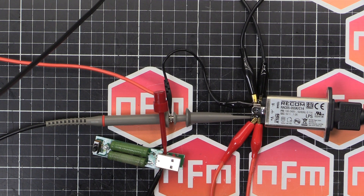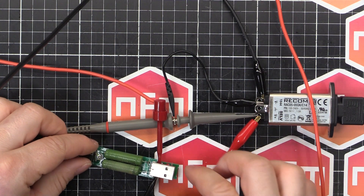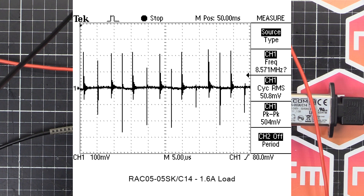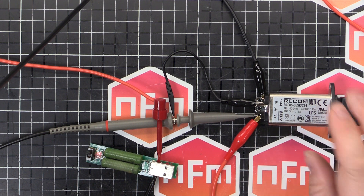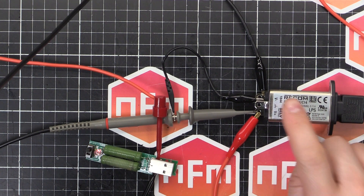If I switch it up to the next setting, which is 1.6 amps — so right now we're at 0.9A and now it's kicking out 1.6A. You can see there's less ripple but a lot more of those little spikes, so it's working a lot harder. This is rated to 1A, and the fact that we can actually get 1.6A out of it at least short-term — it isn't over-temperature or over-current tripping. There's some overhead built into this thing. It can handle start-up loads. So if you've got it hooked up to a Raspberry Pi — they actually mention the Raspberry Pi as a use case — when it's booting it tends to use more power, and at least this can handle that boot-up current.